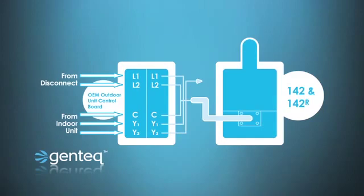The second input is the communication to the motor, which in the case of the outdoor fan motor is just 24 volts. Remember that this motor can be either one speed or two speed depending on whether we have a single stage or a two stage outdoor unit. To get this 24 volts to the motor, there has to be a call for cooling or heat pump at the outdoor unit. First we want to confirm that our indoor unit is giving the proper demand call to the outdoor unit, then confirm whether that voltage is making it from the circuit board to the motor. We would find the Y1 or Y2 wires — the 24 volt communications to the motor — and compare them to the common wire going to the motor. If we know we have a call at the outdoor unit and we do not have 24 volts going to the motor, we need to find out where that voltage was lost.